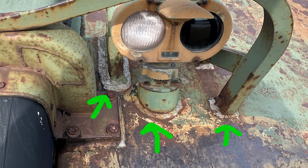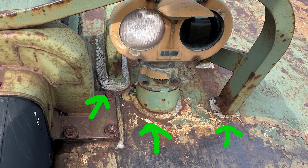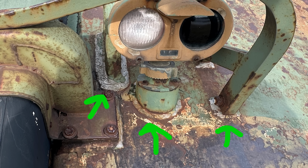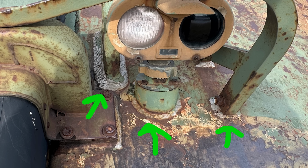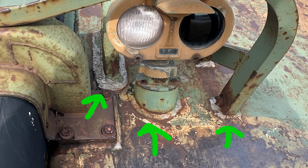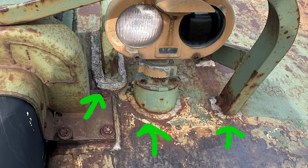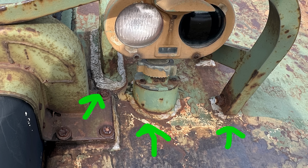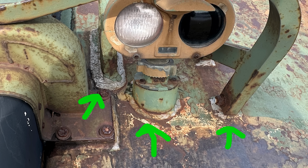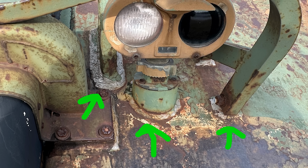In case you're wondering too, even with wire processes, those high nickel, high chromium, high manganese alloy wires, which are commonly found as forms of hard-facing wires with similar compositions to likely what was used in here, they also have a tap water-like weld pool that will literally run at any inclination of vertical up. So likely they did the same, horizontal stringers because you simply couldn't run a pass uphill.